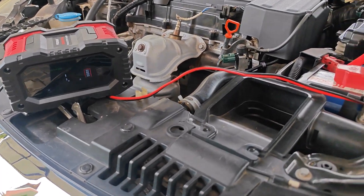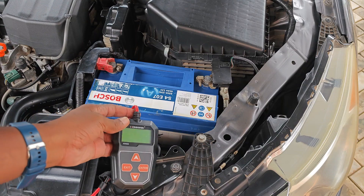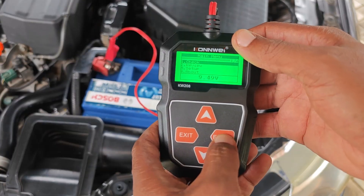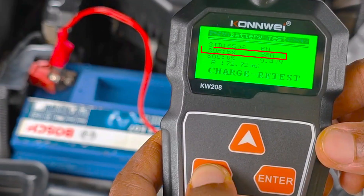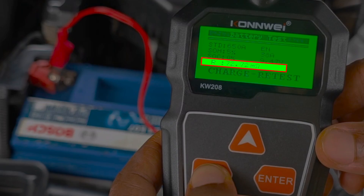I left the 20amp device charging the battery unattended, and by the time I returned, there was a strange smell in the air and the battery was extremely hot to touch. After I let it cool down, this battery has never accepted a charge since. As you can see, the state of health is now at 5% with a very large internal resistance of 72 milli-ohms.